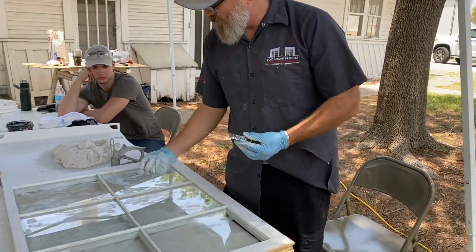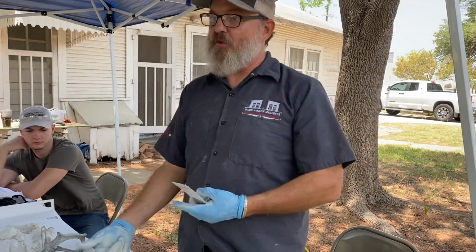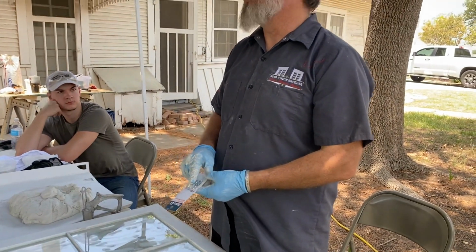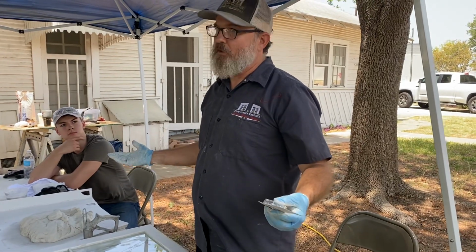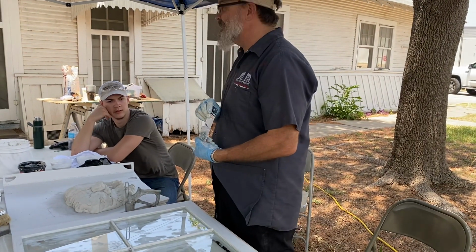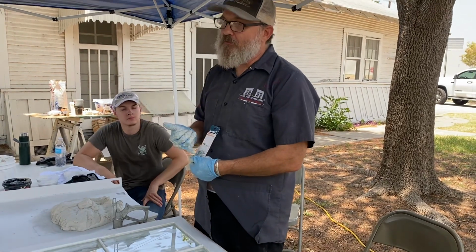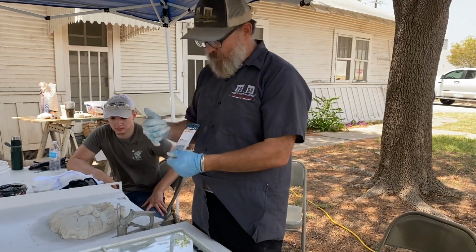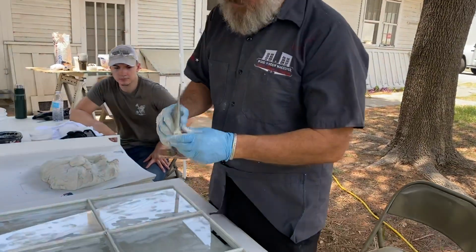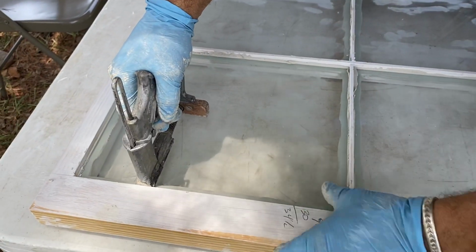The beauty in something small, like one of these diamonds, is that it's easy for the glazing putty to ride over the top and conceal these underneath. These are so big that they stick out. It's like you're trying to play hide and seek, but your feet are sticking out from under the closet door. Everybody knows you're there. It's like they're intentionally mis-sized to make you not want to do it anymore. People who use these actually have to clip them if they're gonna do good work, because you don't want these sticking out, they'll rust. So anyway, I'm gonna pop these guys in. I'm gonna put in maybe two per side.